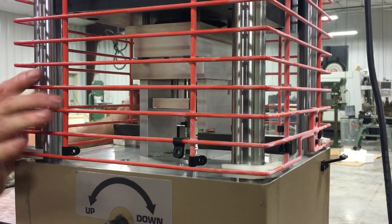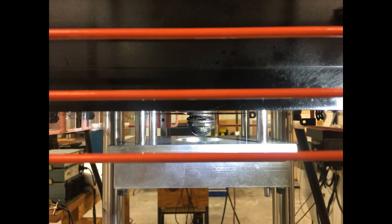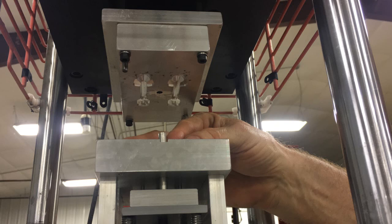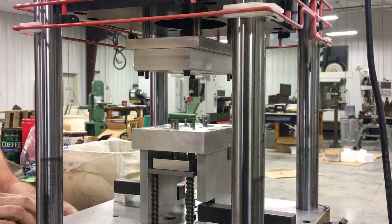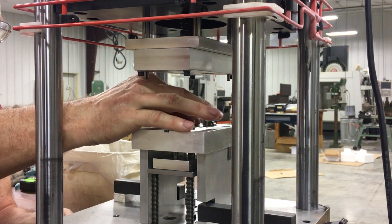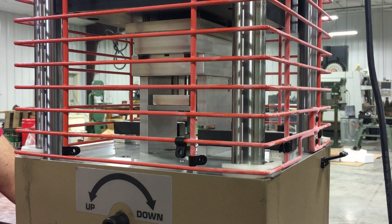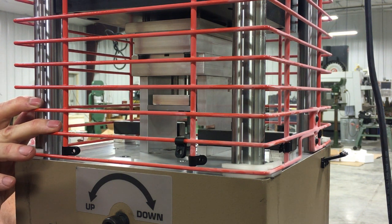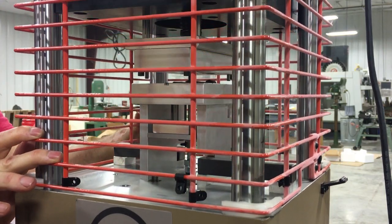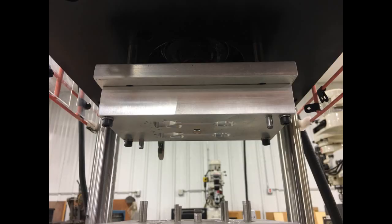The upper mold is fastened to an in-house machine sealing plate. This sealing plate is held in location to the upper platen by four 3/8-inch shoulder bolts. This assembly allows the upper mold plate to move up and against the injection nozzle when the mold is clamped shut. The sealing plate is not necessary but employed in this assembly for slight relocation adjustments in pursuit of an exact fit between the injection nozzle and upper mold plate. Normal variations in the manufacturing processes result in the injection nozzle being out of center relative to the bolt pattern in the upper platen. This can be quickly corrected using oversized clearance holes for the screws that secure the upper mold plate to the sealing plate. The sealing plate can also be used to adapt smaller upper mold plates which cannot utilize the bolt pattern in the upper platen.